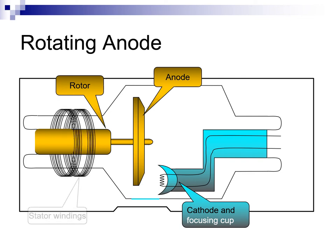These represent copper coils wound around the neck of the tube. They are wound in a manner so that when connected to an alternating current source, they produce a rotating magnetic field around the neck of the tube.